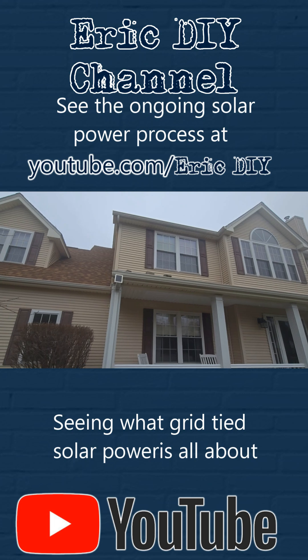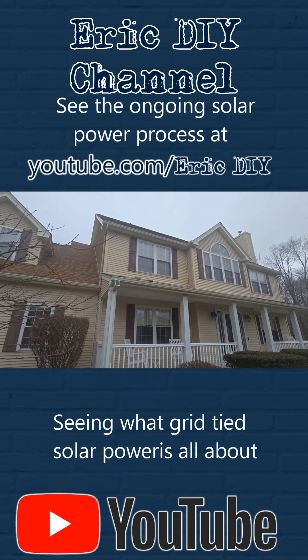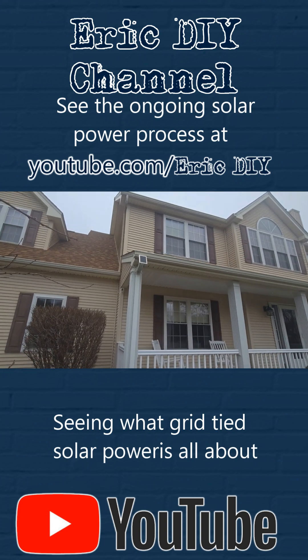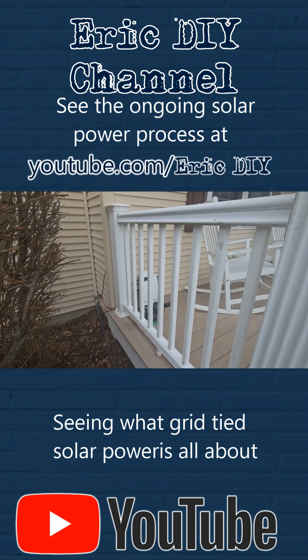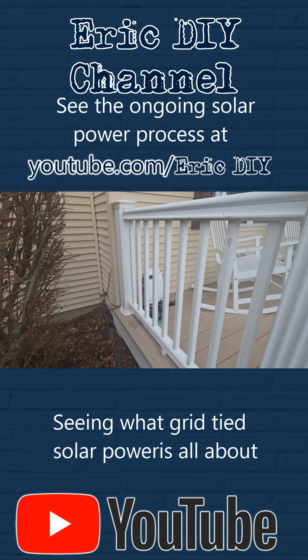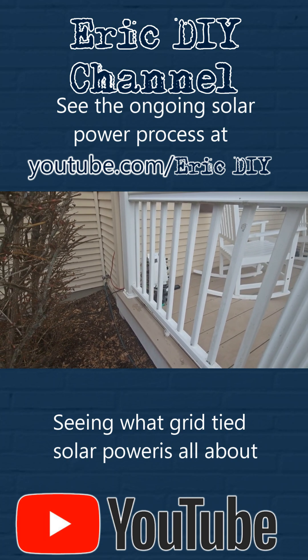You can see I have a pile of rocks — this is a temporary setup. I already have the mounts; they just came in today, but I went and bought two 200-watt solar panels and I have them connected to a grid tie inverter right over here. We're just testing stuff out, so this is in no way permanently mounted right now. It's currently overcast, so it's not making much power. It was making like maybe 50 watts earlier today, but that's total overcast.